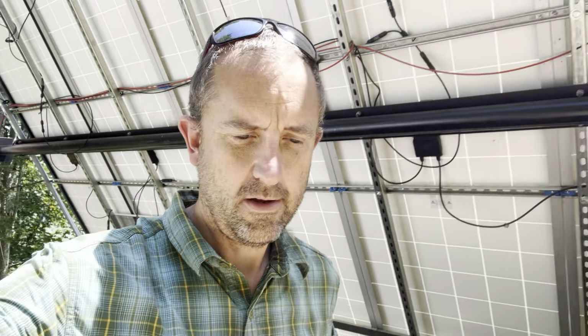Today, again, is the middle of August. I looked earlier and I was pumping out, I think, about 1,500 watts. So that temperature hit really drops your power output when it gets warm, at least in my situation. So 1,500 watts, multiply that by 4 or 5 hours for peak, and then it drops off after that. I'm producing somewhere around 5, 6, 7 kilowatts a day if I have a nice clear day.